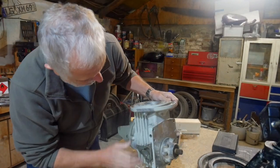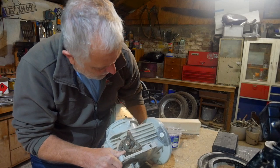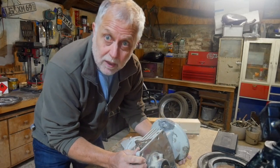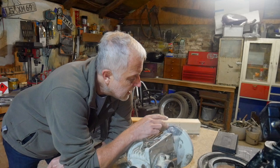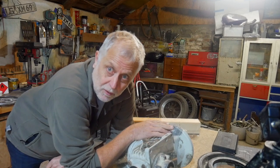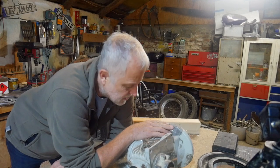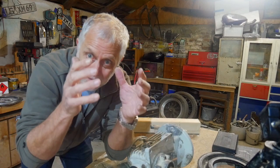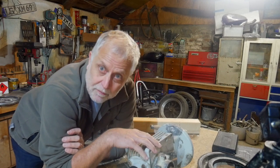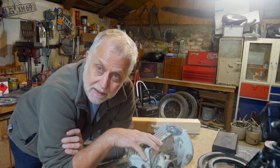I'm really pleased. There's the bottom side. You see that plug there? Hopefully. Looks great. It's sealed properly. And that, I think, is a very good way of plugging those Seacock holes. Now, just to allay any worries, it's fairly common to plug these holes. The water flow up the leg doesn't play any significant cooling action at least. Remember, the entire SAILDRIVE leg is immersed in seawater, so it doesn't get hot. And it's a much better option for me and for many other boats, I think, to plug these things up and put an inlet in somewhere else in the boat.